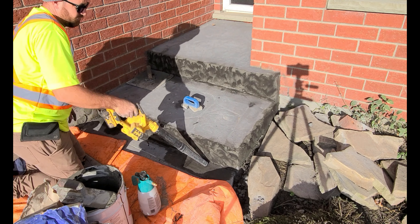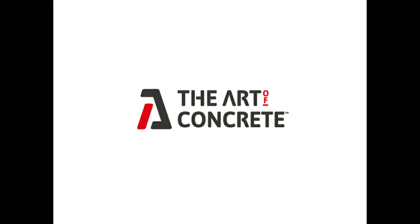The product we're going to be using here is a QC stone gray color hardener. This color hardener increases the strength of the concrete, especially in the northern climates in Canada. It'll help protect that surface and help it bond better. So what I'm doing is just broadcasting this on very lightly, making sure that I don't get any of this color hardener elsewhere.